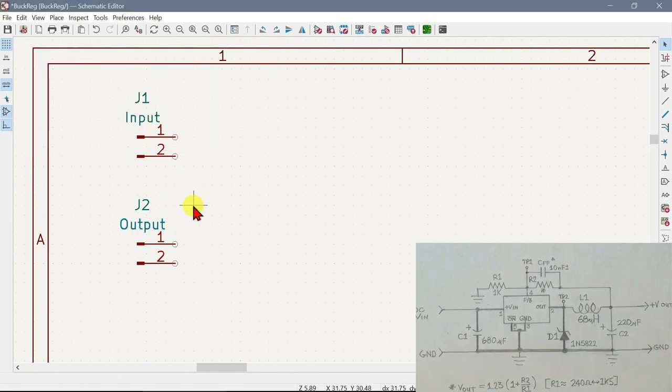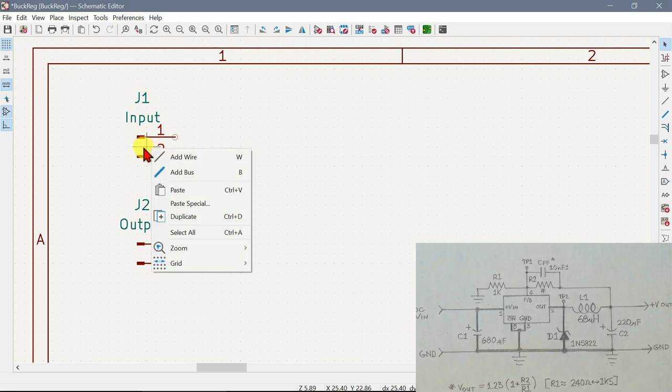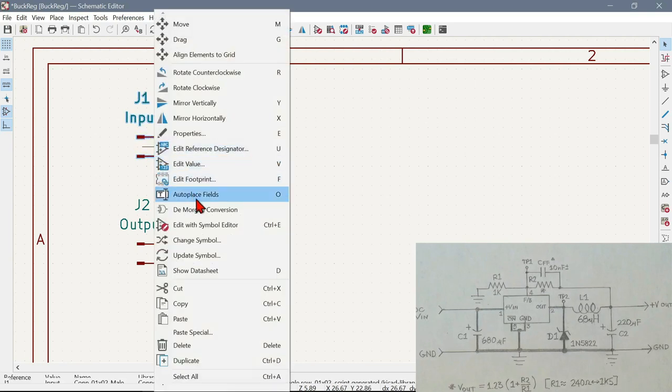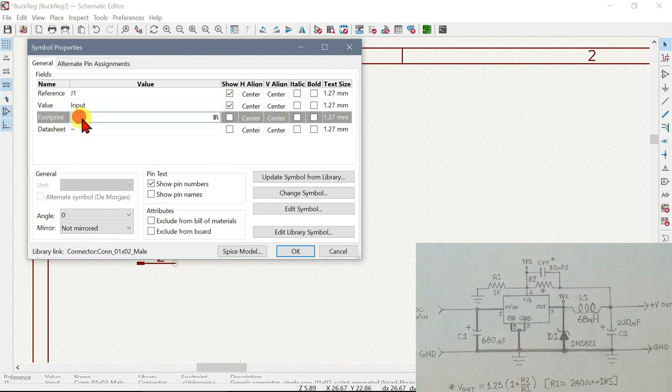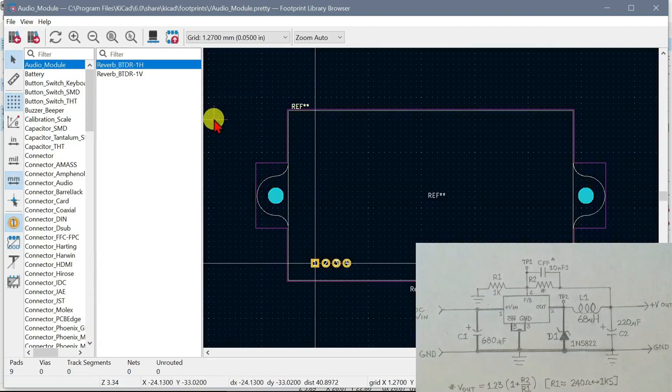And another thing you have to do is tell it, by the time we get to the PCB, it has to know what the footprint of it is. So we can right click it. Oh, we have to select it first, right click it and go to E for edit properties. And as you can see, there is a footprint there, and then you can go to the footprint editor, and obviously I don't know what this is, but it doesn't know.